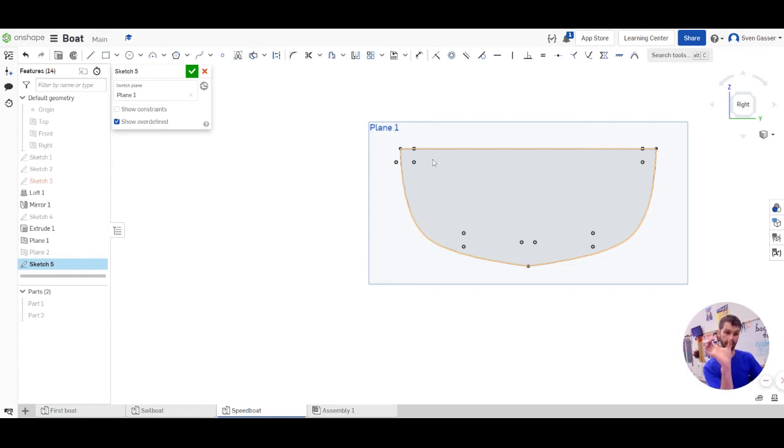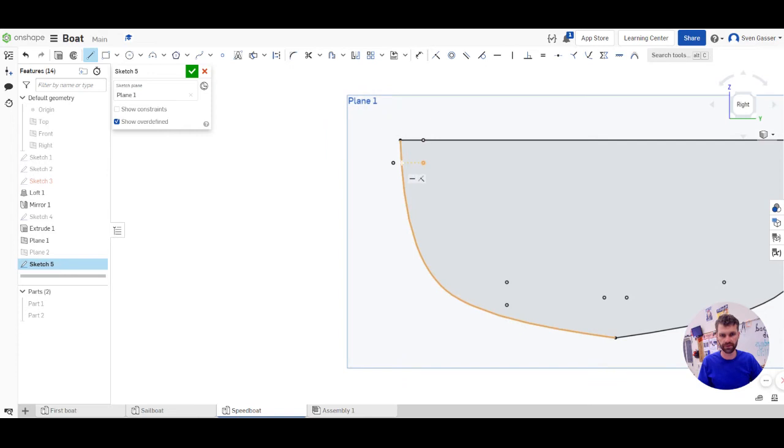And now I have that nice tracing of that. And because the boat got a different size, it might have gotten a little skinnier or a little taller or whatever in some way. Now you can put these corner notches in again, and you might want to make them a little bit different size. So we have the dot there so that we can line things up and they'll still be in line. But maybe it needs to be a little bit wider out here, for example, and you need to say, hey, I need this dimension to be a little bit different and wider here. Maybe you want that to be 1/8 of an inch there.